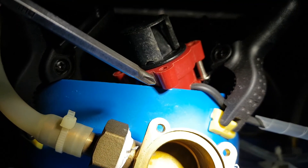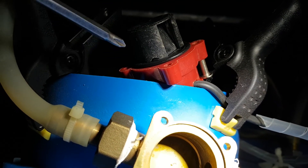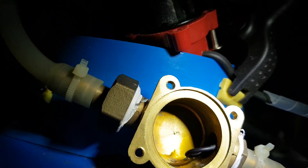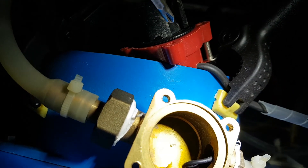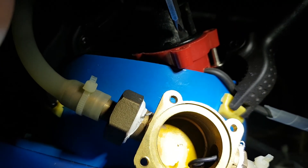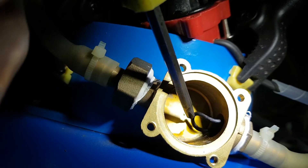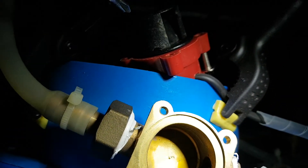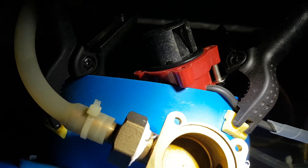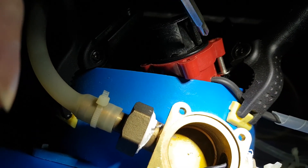I've undone this and it's upside down. This side over here is this side over here. So when the water flows down and you're wanting the flap to close, it's getting jammed up on the O-ring. So it's either stopping it from going down on this side, or it's jamming up in here somewhere and not allowing it to move.